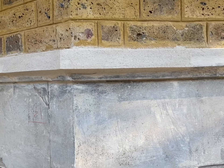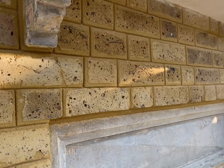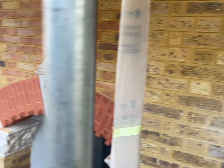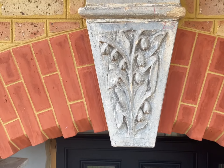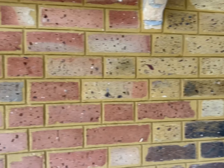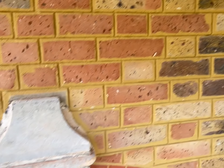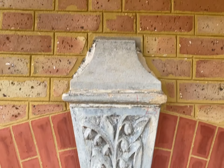I'm just going to give you a close-up and show you how that looks. As you can see, as always, a beautiful finish to the brickwork — all of the archwork being penny rolled and all of the London stock brickwork being penny rolled. This combination works really well if you've got a multi-facade with red brick and brick features on it. So all repointed in natural lime mortar.